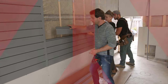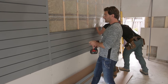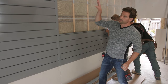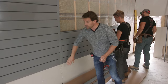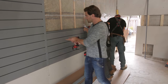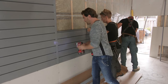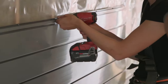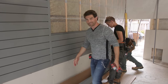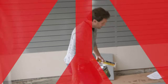With the walls insulated with Rockwool and the vapor barrier in place, we're starting to finish the perimeter walls. Some of it's going to be a slat system — we're using Pro Slat here, which gives us the freedom to move hooks around on the wall. The bottom two feet and the top two feet, I'm splitting a sheet of drywall. It's not really usable space, especially if you're parking a car in here. But with this easy-to-install system, we're going to maximize our storage potential and have a bit of a workshop — and it's going to look great.